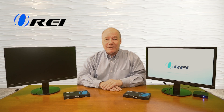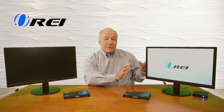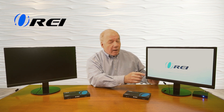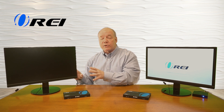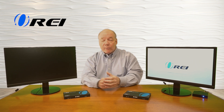Now I'll show you the connections you'll need to make to use this product with your own equipment. This side of the table represents the primary location where you're currently enjoying the content — I've got a small media player connected to a monitor looping a video that I'd like to share with my remote location. This other side of the table represents that remote location. Keep in mind these two locations can be up to 100 meters apart, connected only through a single CAT-5E, CAT-6, or CAT-7 cable. I have the transmitter module here and the receiver module here.